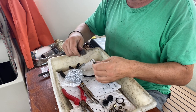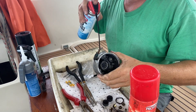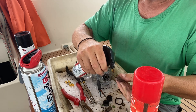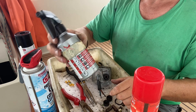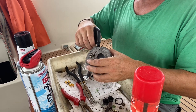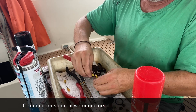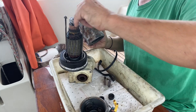Just cleaning up the wires a little bit. I'll put some contact cleaner in there — it evaporates so it doesn't leave any residue; you don't want that residue attracting carbon dust. This is like an oil that protects, insulates, and lubricates the electrical components — just a very thin layer of that on the contacts.